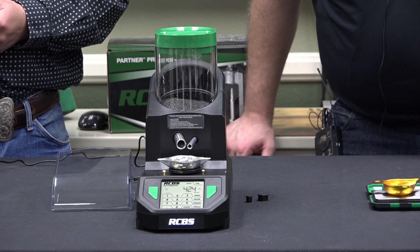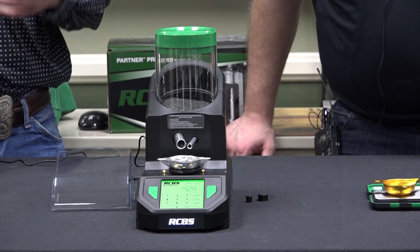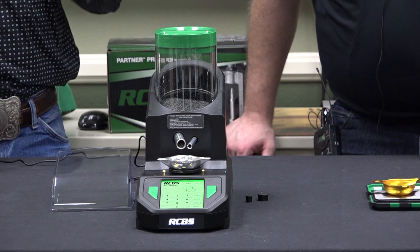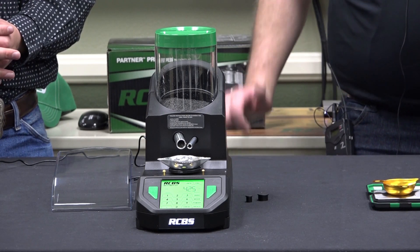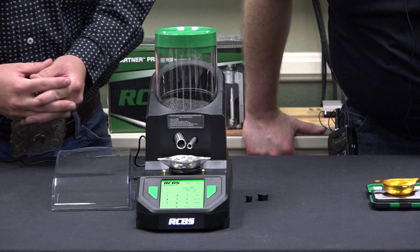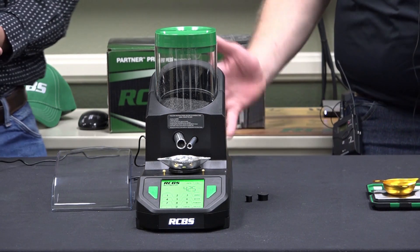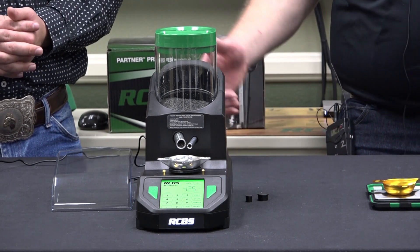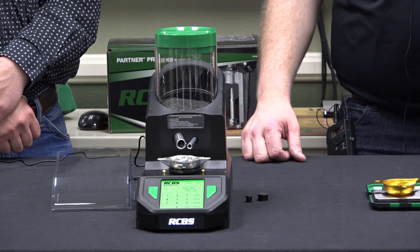It's just trickling up that last kernel. Now one question while it's dispensing — I know in match mode it's very sensitive to any vibration on the table. Is standard mode a little less sensitive or would you still want it on a very stable platform? This one's in standard so I can just blow a little air across it — and if you watch the screen, it still picks up that air. So if you're using one of these dispensers, you do want it on a very stable platform, preferably off a different table than your bench, because any vibrations could cause a kernel to go through that unit.